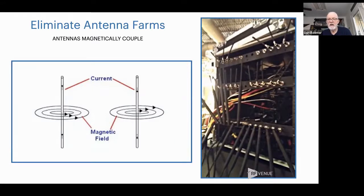If you've got to have an antenna farm, you'd ideally space all those antennas six feet apart — but how you're going to put 20 antennas six feet apart is going to take a really big desk. So you always want to use the fewest antennas possible. For wireless mics in a single room, that usually means one diversity pair of antennas, and it may be one antenna for your in-ear monitors, although there is a difference there — we'll talk about that.